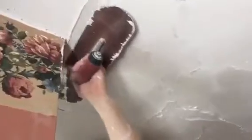Because otherwise, your trowel keeps knocking it down and knocking it around. You want it to be less and less impressionable as you move along, okay? So I'm just generally moving it along where I want the plaster. I know where I need it already. I need it right here. So it's going to remain soft in order for me to get it where I want it.